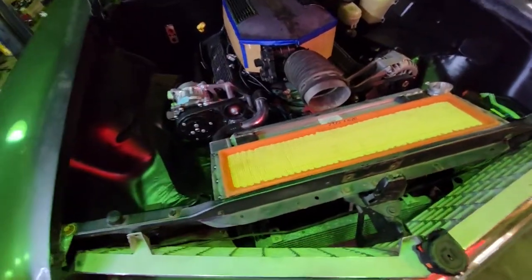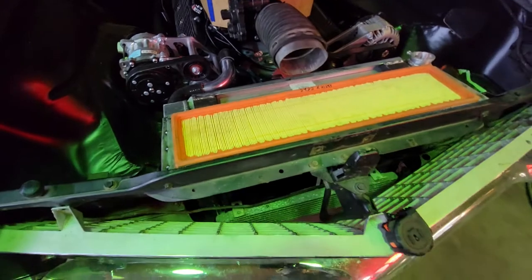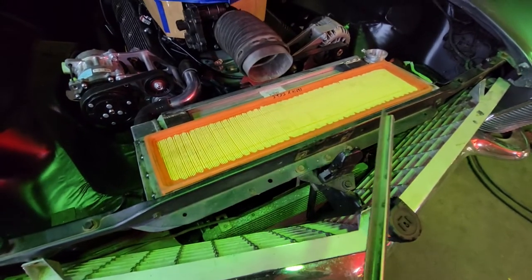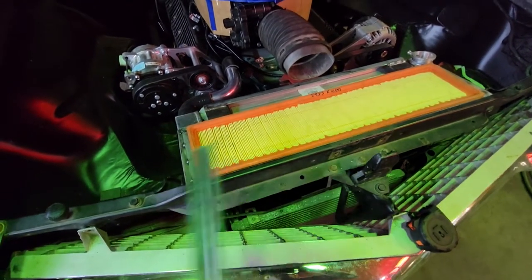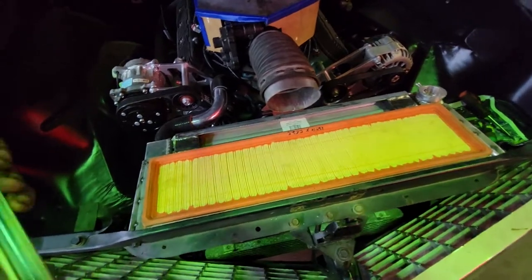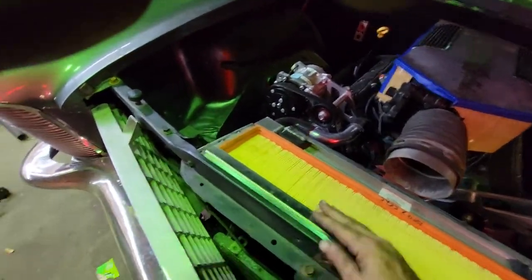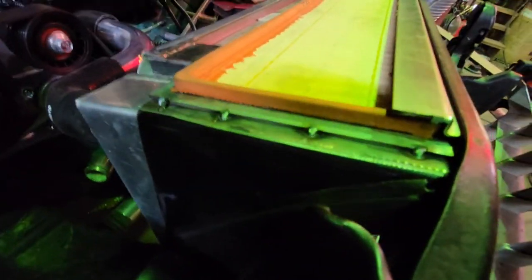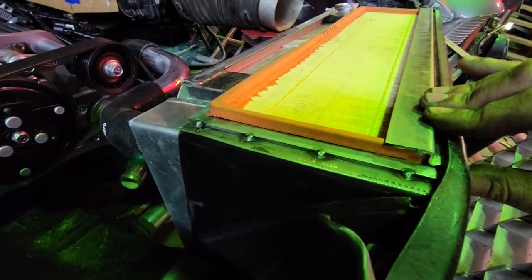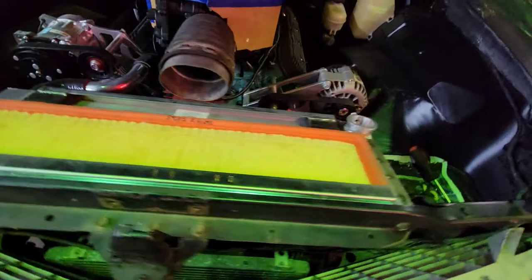What I was getting at for using what you got — I needed to come up with a flange to seal the top of this air cleaner off. I figured it needed to be at least 14 gauge because I have no way to get a fastener in the front here, so it's going to have to be pretty rigid. Bolted on the corner so it'll stay sealed in the middle and not flex on me. It took me probably a couple hours of wandering around the shop to find something that would work, but it drops in there perfect. By the time that cinches down, it's not putting too much pressure on the airflow filter foam, and it'll give me something decent to build off of for the rest of the duct.